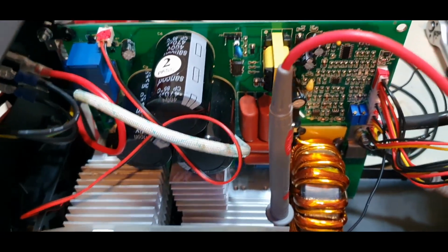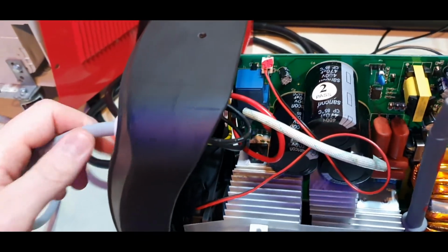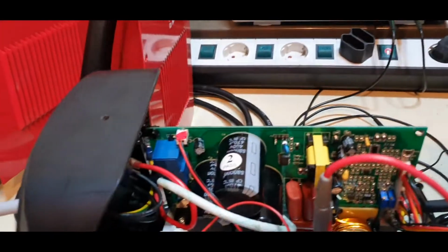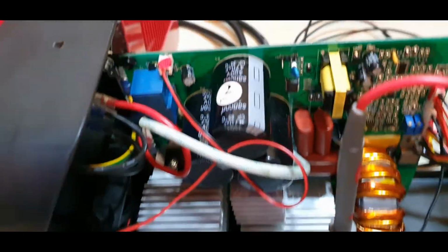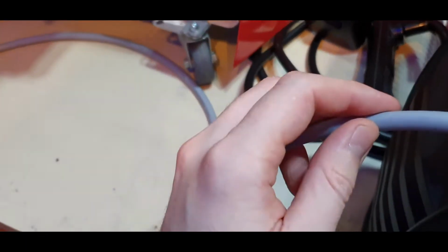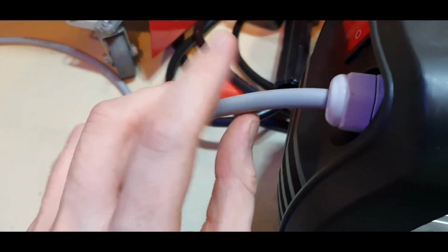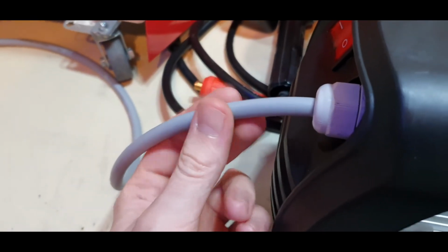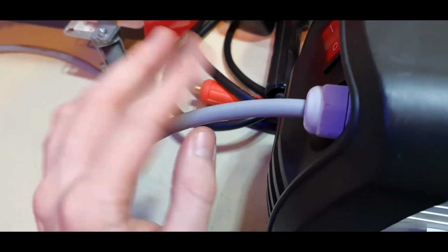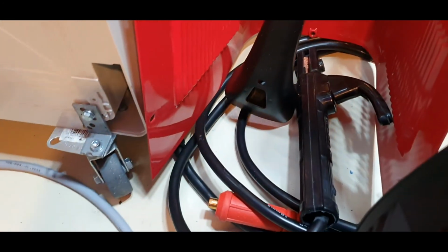And yeah, in the next video I get a better cord and we make a load tester basically, some carbon arc test basically. With better cord I mean simply one with thicker insulation, because this is 3 times 2.5, so that's enough for the current, but the sheath is very thin. It's like a reduced sheath thickness for softness, because it's for installing inside of machines, basically this kind of cable.